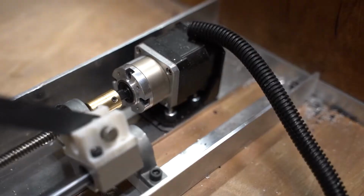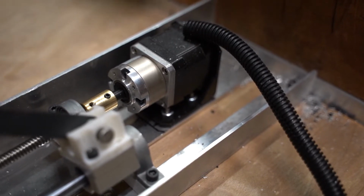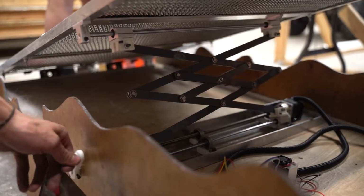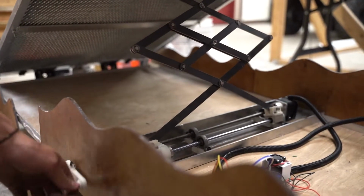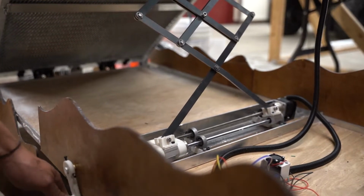A motor is then connected to the end of the screw rod at one end, while a hand crank is connected at the other end. This allows the lifting mechanism to work electronically or manually in case of a malfunction or no power source in the presenting area. The lead screw is driven and drives the scissor lift up and down, enabling the slope board to reach the desired avalanche slope angle.